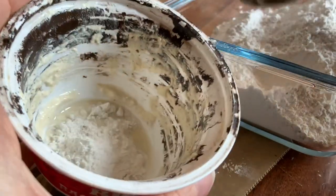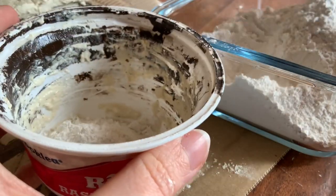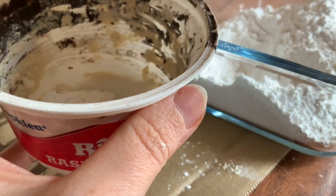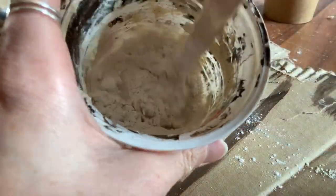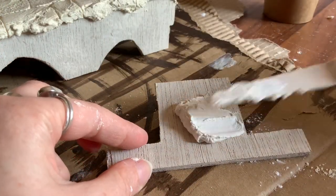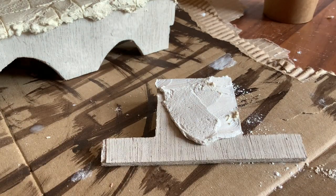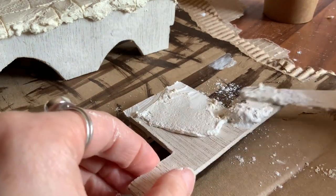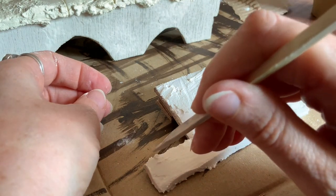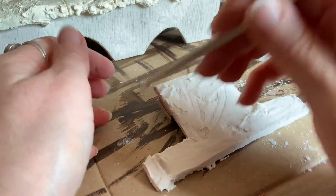Now I'm just mixing up some polyfiller in a little recycled pot. It's got paint all around the edges, but that's okay because even if that gets into the polyfiller, I'm going to be painting this afterwards. So I'm doing a couple of spoonfuls of polyfiller mixed with a little bit of water to make it up to a consistency that I want. Then I'm smoothing my filler onto this little hearth area that I've made out of plywood, ready to scrape in the brick patterns. I'm going to scrape away where the bricks would be — this is using exactly the same technique that I used for the brickwork up my chimney breasts, and I will attach a link to that video at the top of this video if I can work out how to do it.